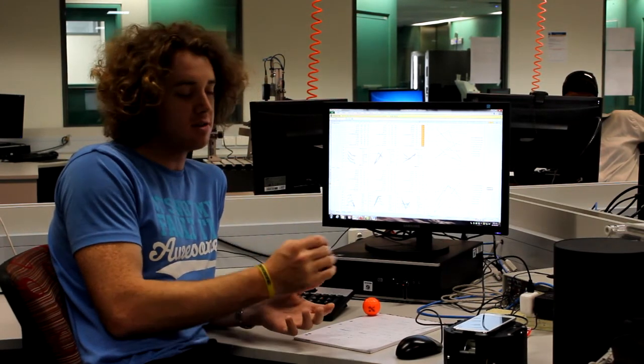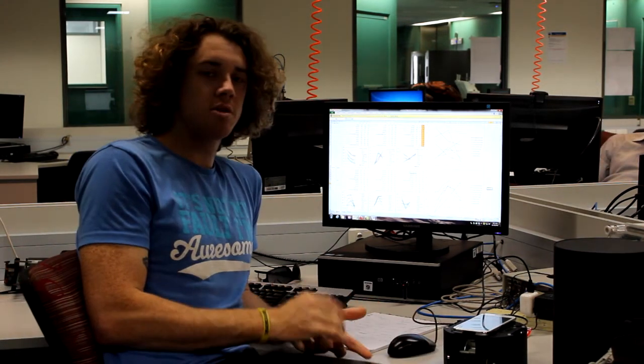To get the thresholding values, we had to run a series of tests. This involved using a camera that was supplied and the soccer field. As you can see here, this is an Excel spreadsheet of the values that were recorded. This describes the 3 main colour spaces that we investigated. It shows how each colour trends in those colour spaces, and ultimately was used as the thresholding values for the robot colour segmentation.